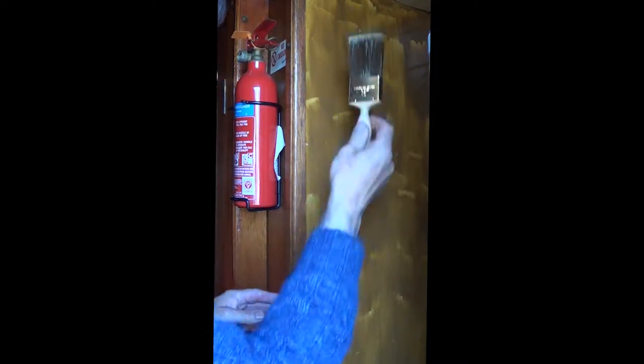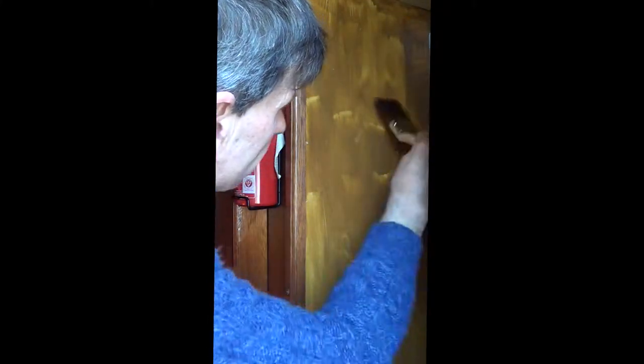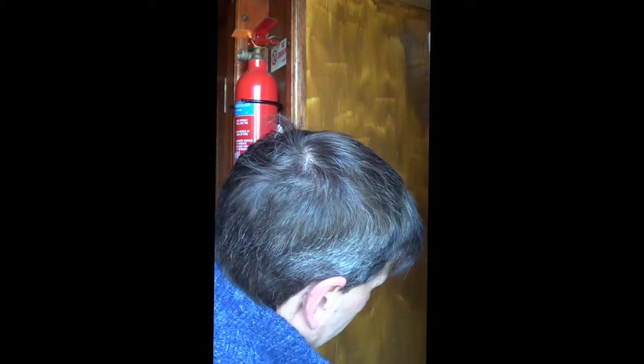The scumble is applied. I've now got a brush and I'm going to feather it down a little with a soft brush. I'm not too worried about light and dark areas because the brush is already starting to give us lines — I just wanted to get it distributed as evenly as I could. The brush starts to give almost the lines of wood grain, which is basically what we're trying to replicate.